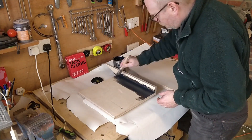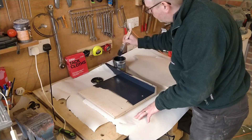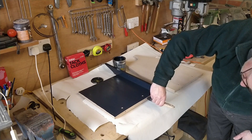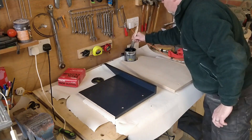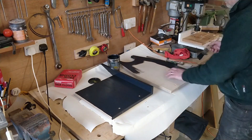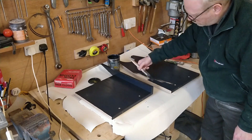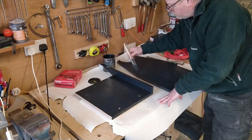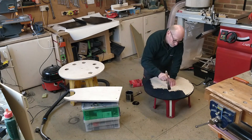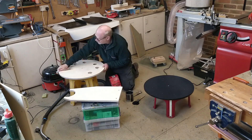I'll be interested in how you go about finishing projects. My approach is to sand, vacuum and then wipe down the part with a tack cloth, leave to dry, then repeat — but just sanding lightly with 220 grit paper. These parts had four coats. The manufacturer's instructions advised three coats, or two if already primed or painted. The paint was pretty expensive and I ended up using almost all of it. But I've used this paint before and it gives a very hard durable finish, is rated for external use with a 10-year guarantee. My own Dobsonian telescope mount used the same paint and is still good as new after five or six years of use, so I'm confident it is suitable for this application.